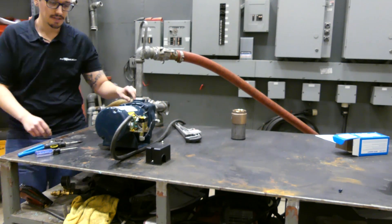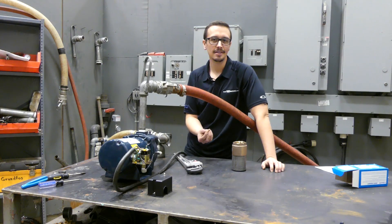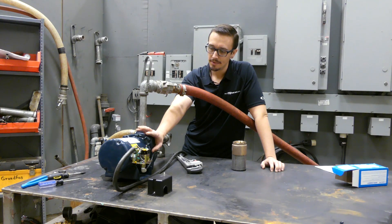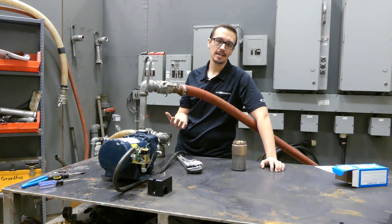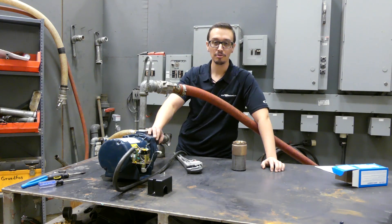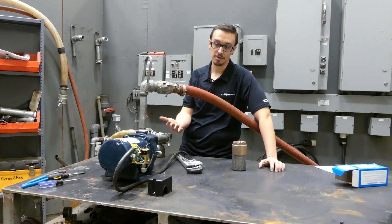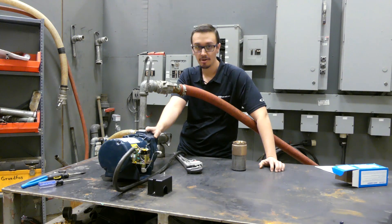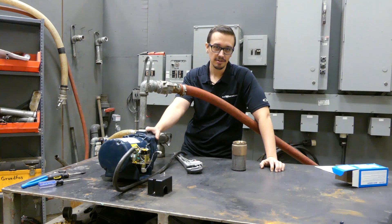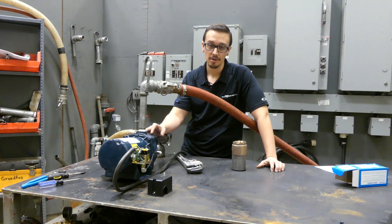After running the pump, there's definitely an audible grinding noise — it sounds like there's gravel or something — and it seems to be emanating from the motor side of things. This doesn't sound like anything that's really repairable because it's internal to the motor. Yes, we probably could fix it, but it's a brand new pump just from the factory not long ago, so we're going to send this to the factory for warranty repair. Had it been a broken impeller or leaking seal — something easily replaceable — we might have dug further into it, but tearing apart a motor under warranty just doesn't make sense.